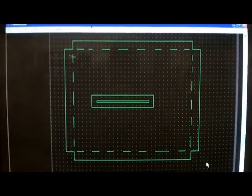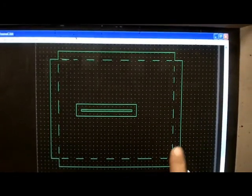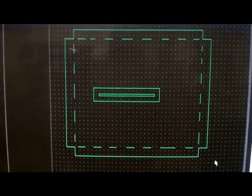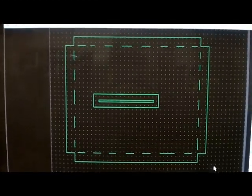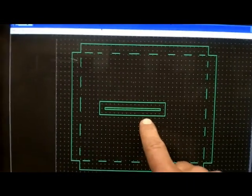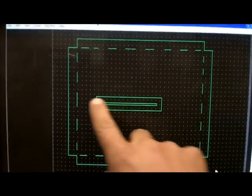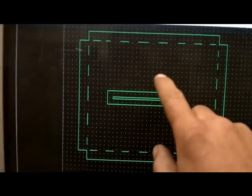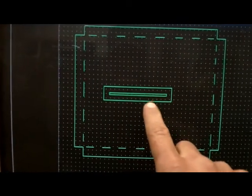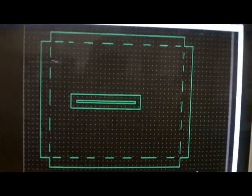Okay, so this is what I've got for the firebox — it'll be a big pan made of 1/8 inch with bent up sides. The slots are in there because my brake can only handle 14 gauge, so the slots make the bending easier and also drain water if it's left out in the rain. This center part won't be cut out of the 1/8 — there will be a smaller hole cut out of the plate and then this part will be cut separately out of stainless steel. The air is going to come up through that little slot. Stay tuned for part two — we'll finish it up and get it going.